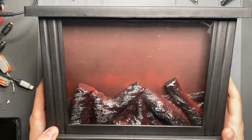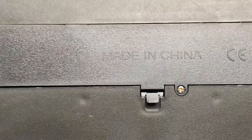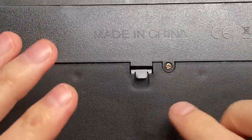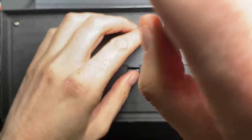This one's a bit interesting because it doesn't really match the one that he did — it's a little bit different. It has, actually on the back, almost like an afterthought, this micro USB port that looks like they just chewed the plastic to make an opening for it. I'm glad that it's there because my intent was I was going to have to hack it and make it accept five volts with a diode drop, because most of the ones that I saw only had a battery compartment.